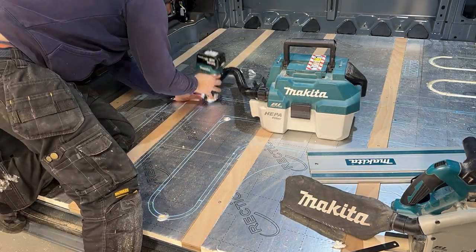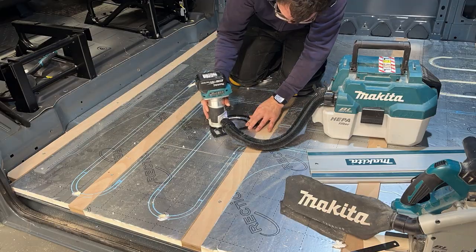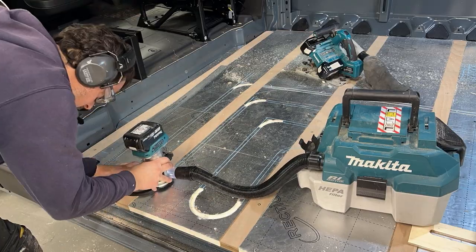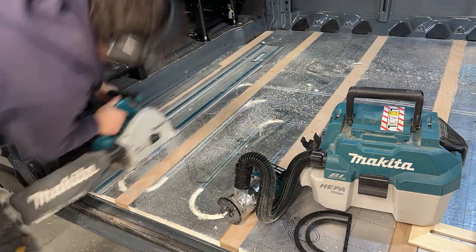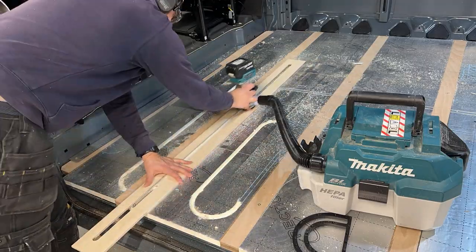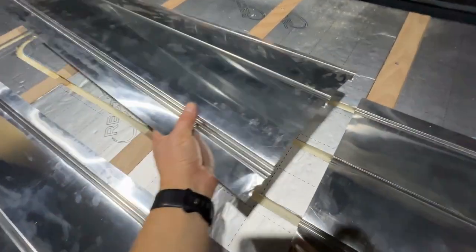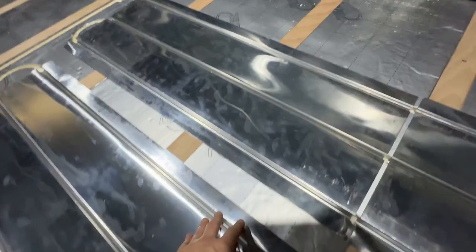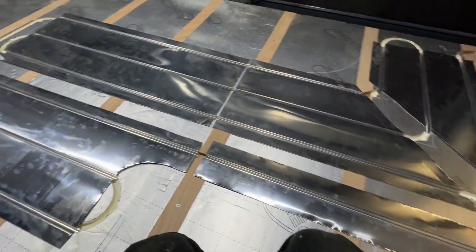When you're routing, just make sure the bit in the router isn't spinning as you insert it through the template — pop it through, then turn the router on and start the cut. It is worth having some dust extraction whilst you're doing this because the Celotex can produce quite a lot of dust. If you don't have any dust extraction, you might want to consider using a knife or similar to remove some of the Celotex before you start cutting. Once you've done your track sawing, you can just peel off the top layer of the insulation — that means you'll get a cleaner cut when you run the router through and create a bit less mess. Our grooves have been cut now, all to the right depth. All we have to do with our plates is just push those into the grooves — it's a nice compression fit. No need to worry about any glue or anything like that. Just try to leave plenty of clearance around the U-shape so you can push the pipes in.